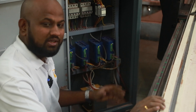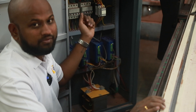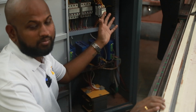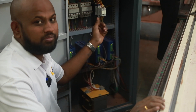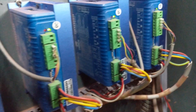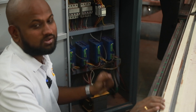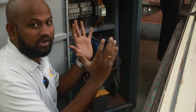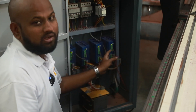The electronics inside a CNC machine are similar across builds. First, there are MCBs for safety which will switch off in case of a short circuit. Then there is a starter which starts up the entire machine, starting up the transformer and then the other controls. There are four stepper motor drivers — why four when there are only three axes? Because there is one motor on each side of the Y-axis since the Y-axis is heavy, holding the entire gantry. So there is one for X, two for Y, and one for Z.